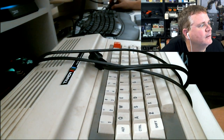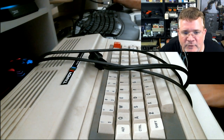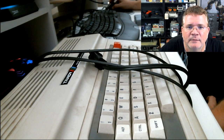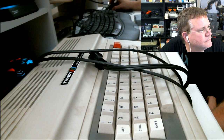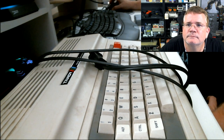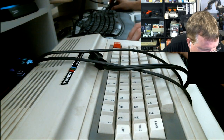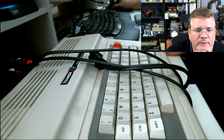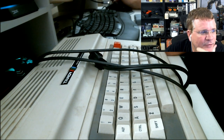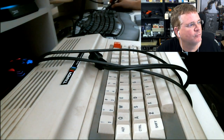Interesting. Yeah, and I think I've asked this question, and one of you guys already answered it, but if you get a 2 meg, you already have the 512, right? So RAM is RAM, and it's all addressed kind of the same way. Yes. And so any of the original CoCo stuff that required 512, that memory is addressed the same way it would be on a 2 meg upgrade? Yes. I don't think there's anything that is incompatible with the 2 megs. I'm not aware of any anyway. Okay, anything that runs in 512K ought to run on the 2 megs. Well, that's good to know.